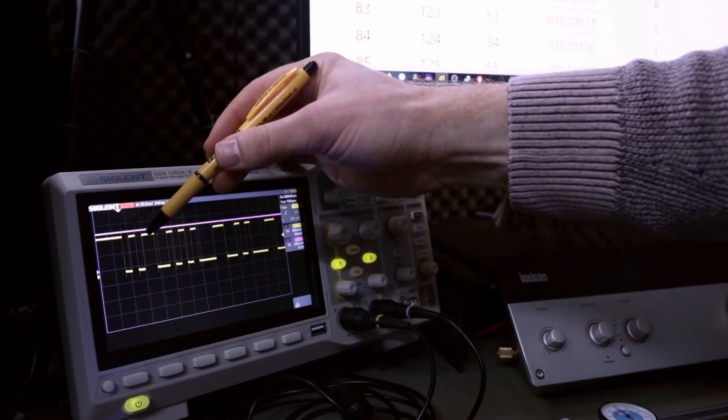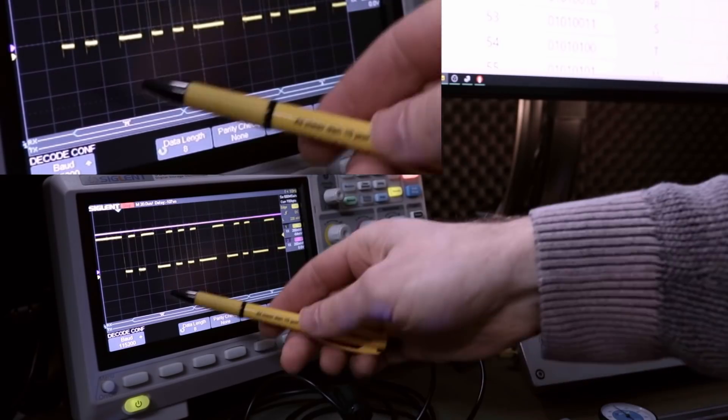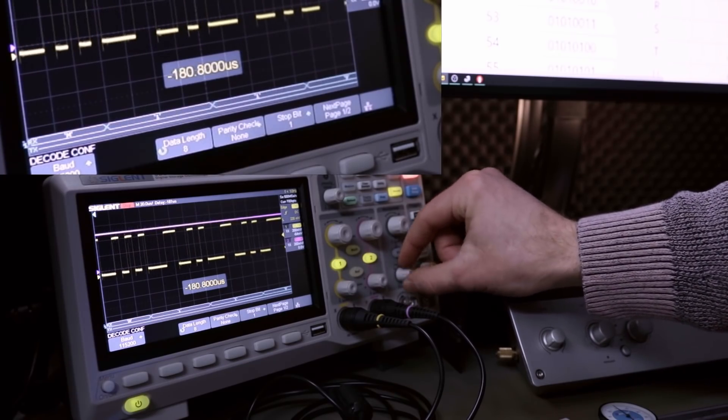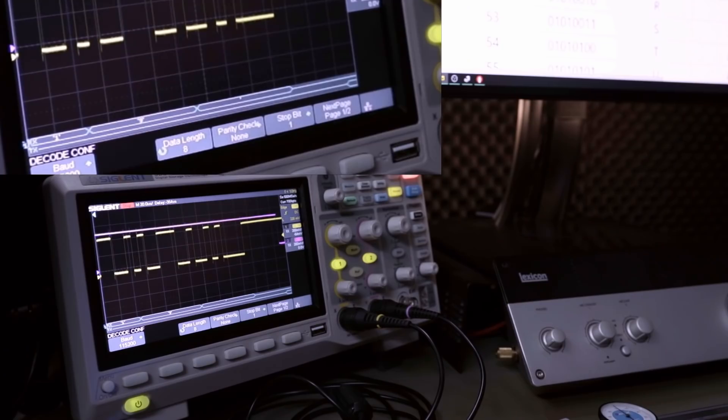So that's the character M. Fortunately for us, we don't have to count all those individual bits in order to know what we are sending and receiving, because the oscilloscope has a decode function. If I have the protocol right and the speed — it must be set to UART and the speed at 115200 — you can see that here the letter M is presented, and then comes the 1, and another 1. The next character should be a 9. Here we are — that's the command M119. Then the board needs a moment to think what M119 means, and then once it knows what to do, it's going to do whatever the firmware is programmed to do with M119 — in this case, replying with the status of those end stops.